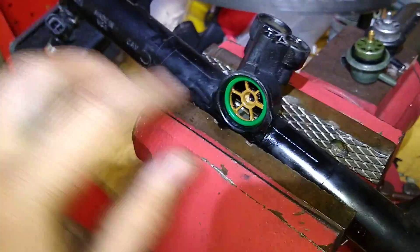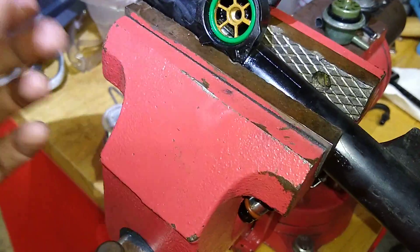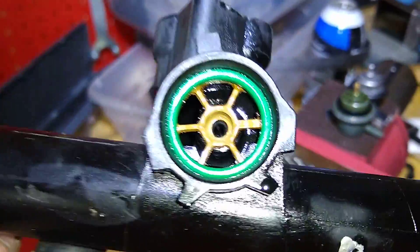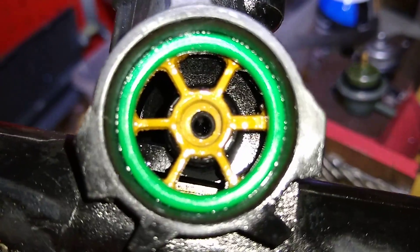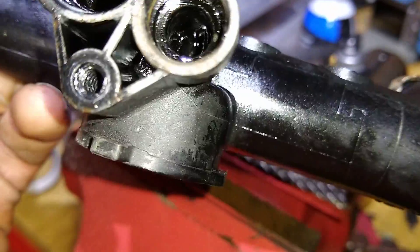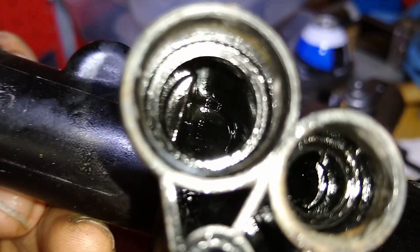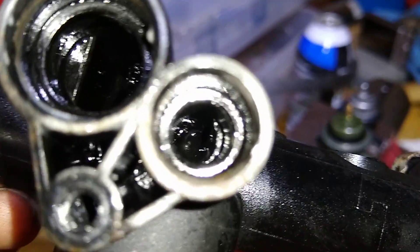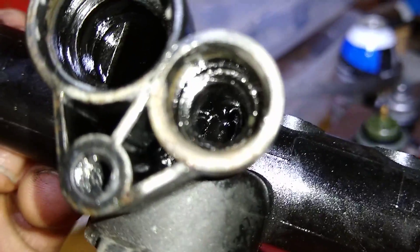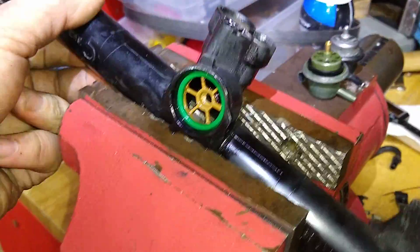The modification you do on the actual rail itself is: one, you can take the screen out, but I believe you need the spacer, so I just take the screen out. On the inside, you don't want to touch where the O-ring sits, and you don't want to touch the outside of that brass because that creates your seal. But if you follow that hole to the other side of the reg, you end up with that cavity down there. I opened that cavity up a bit using the diamond bits, but I don't think that was the major difference.